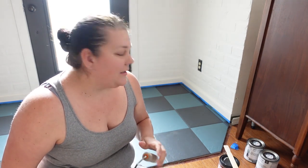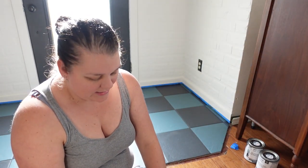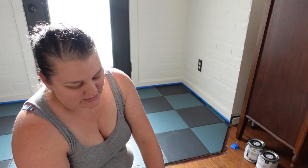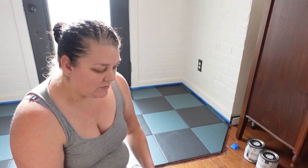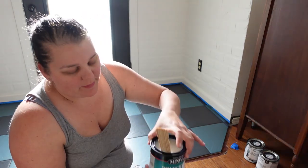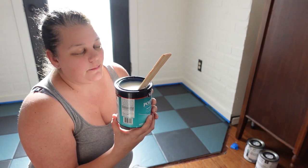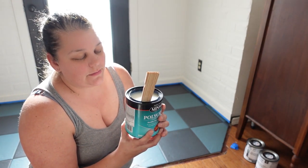I think I'm probably going to go for four top coats and I'm going to use polycrylic, although it hasn't always worked out great in the past. If I really don't like it down the road I can always sand it and do a different color over the green. The polycrylic instructions say allow three hours before light use and 24 hours before normal use. Apply a thin coat using a high quality synthetic brush, lightly sand after at least two hours, and apply two to three coats if desired. I should be able to get all the coats in today.